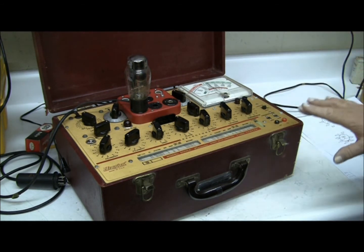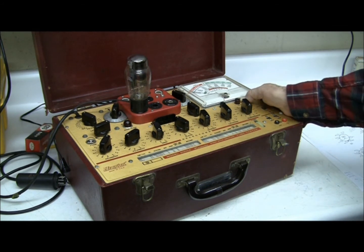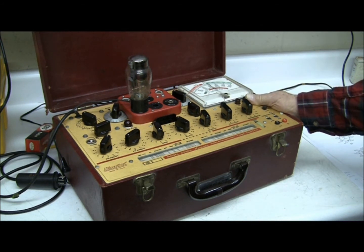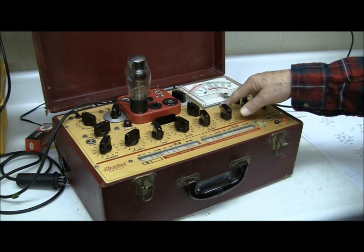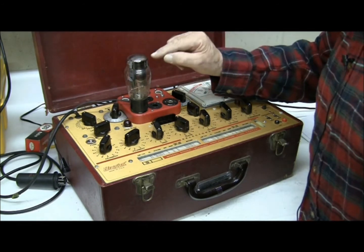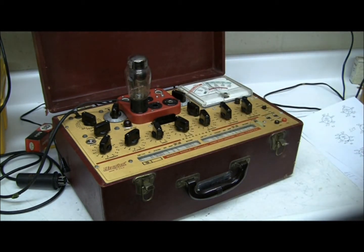When you're all ready to go and all of these have been set to the right function, you can push the button that says 'gas.' Sometimes gas accumulates in the tube, and if the tubes get too gassy, you're going to run into trouble. But this is just fine — you notice that goes way down to zero, that's good. Filament continuity — it says it's good. I can tell you that it's good because when I look in the top I can see that the filaments are slightly red, and when I touch it I can feel that the tube is hot.